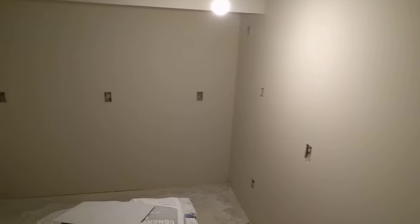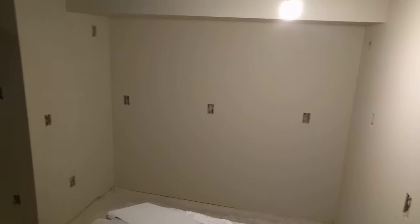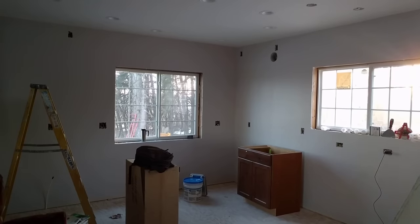In this case, this is a home office, and so we've got lots of options for places to plug stuff in, but everything that's going to be plugged in is going to be extremely low amperage or wattage. I've seen general guidelines or rules of thumb for number of outlets on a breaker, and what I've found is that they say you could take each receptacle and just say that it's 1.5 amps off of that circuit.